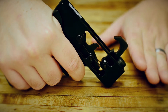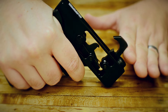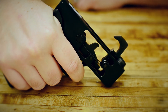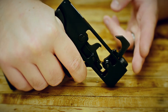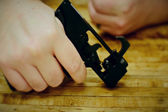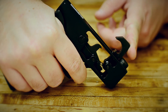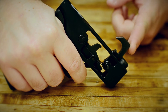After every round is fired, basically the force of the shot will move the bolt carrier group backwards and it will lock the hammer back and then it will fire again. Now if you hold the trigger down when this happens, you'll actually engage the hammer on the disconnector. The disconnector is basically there to make sure that even if you're pulling the trigger back, after the round is fired and the hammer comes down, this little tip of the disconnector will engage onto this notch in the hammer.